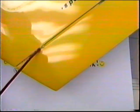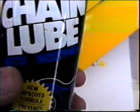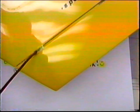Because we're going to fly this in the next couple of days, or this weekend maybe, I take some chain lube even. This is chain lube, motorcycle chain oil. I go right through all the hinges. I'll let this sit overnight. I can let this sit right on the hinges. Now it comes out as a liquid, but it solidifies to a grease. It's just ordinary motorcycle chain oil. This is Bel-Ray. PJ1 is a good brand. If I let that sit there overnight, it'll pretty much disappear, and all that'll be left is a little bit of grease. And that grease will free the controls up and make the first flight a lot more fun. And these are pretty free, but you never have controls that are too free.